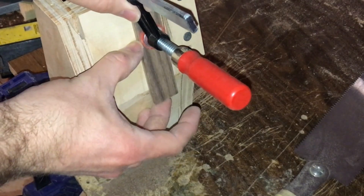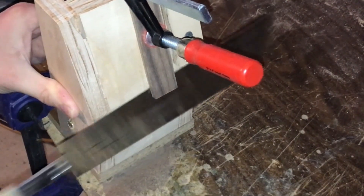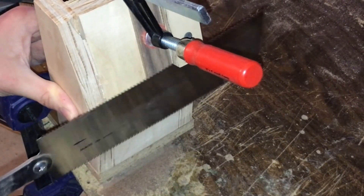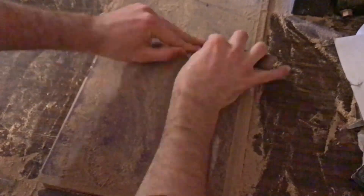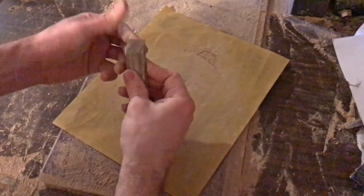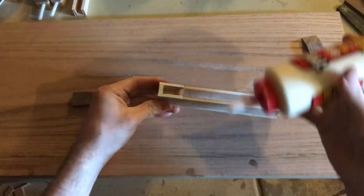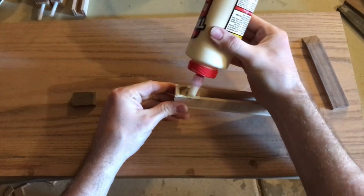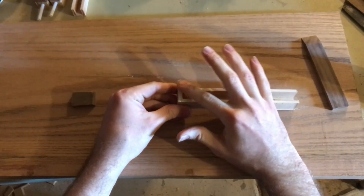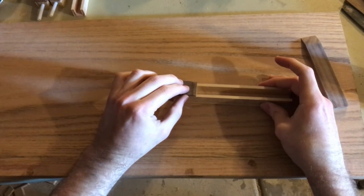For the walnut pipe fronts I'm using an angled fixture block to rigidly hold it while I cut the upper lip. I've got some thin cardboard glued to the area surrounding the block which will create the wind way for the pipe when the walnut cap gets glued on, and I'm attaching the top half of the front as well.